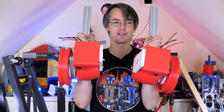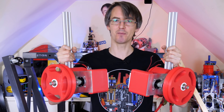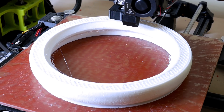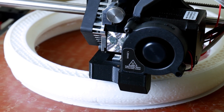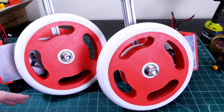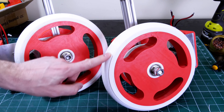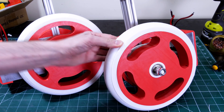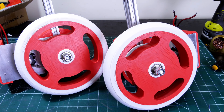There are two of these and they're opposites. The wheel will be bigger with the tyre on, and the whole thing is going to stand around a metre tall when complete. The tyres are printed with the HS 1.2mm nozzle — I've never printed NinjaFlex before, so some quality suffered and I need to tweak the profile. But they seem fine — bonded well and pretty tough — with about 25% infill, and they only took 15 hours with that massive nozzle.